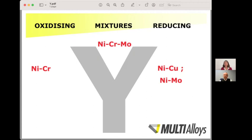It looks like we can use these nickel-based alloys in many different areas. So can we chat about some of the environments where they can be useful? Nickel alloys come into their own when the corrosion conditions are extremely severe. This inevitably results from the combination of temperature, pressure, of course the corrosion media itself, maybe flow conditions, and most definitely the presence of contaminants. The overall conditions might be so severe that they render stainless steels unsuitable. Particularly, these contaminants are often at an unpredictable level.